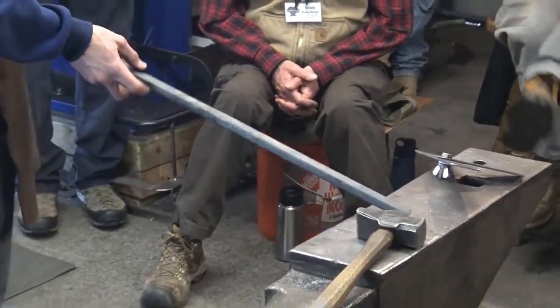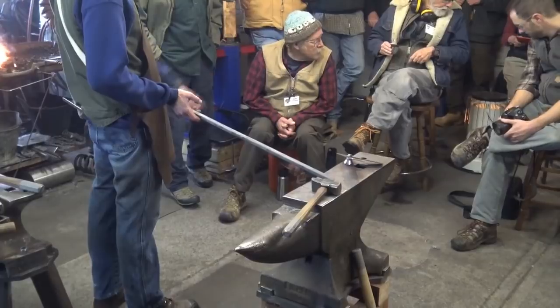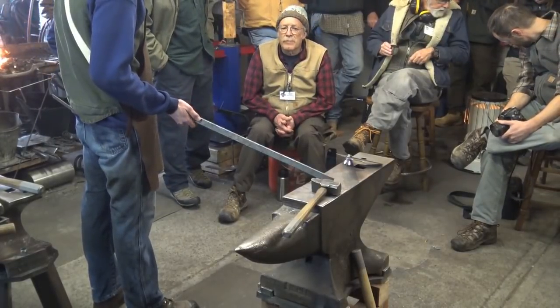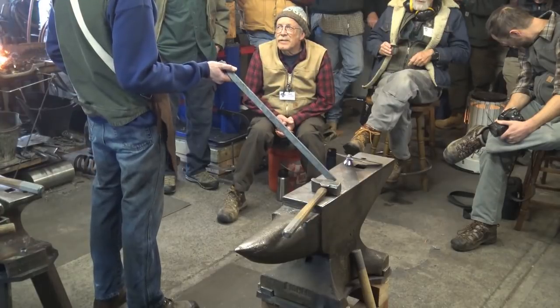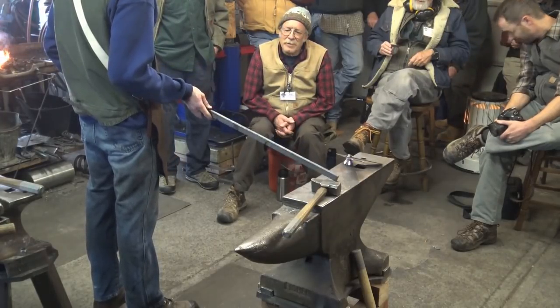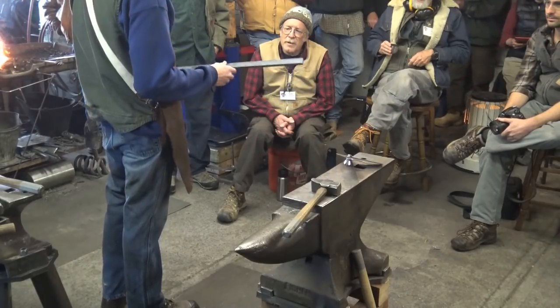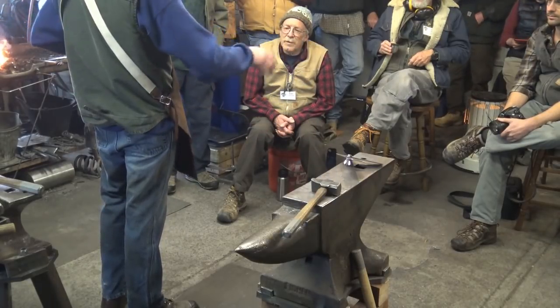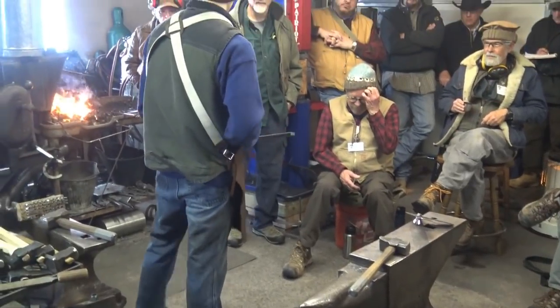1/2, I would have preferred 1/3. I like just the heavier look that it has on the stand, and I saved you guys the boredom and tedium of watching me break corners on the power hammer, but I just heated up the lengths of the bar and just knocked off the corners under the hammer, make it look a little less like store-bought bar.